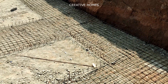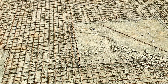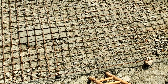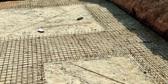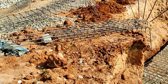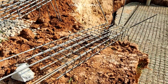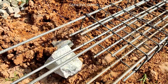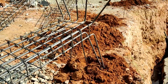That is why at this site we are going with a raft-type foundation. You can observe that wherever the column comes, we have created a band along the periphery, and wherever there is a center column, that column has been connected with the peripheral row, such that all the columns are interconnected at the footing level, ensuring no unequal settlement happens at the foundation stage. These columns will be placed at their respective positions on the footing.